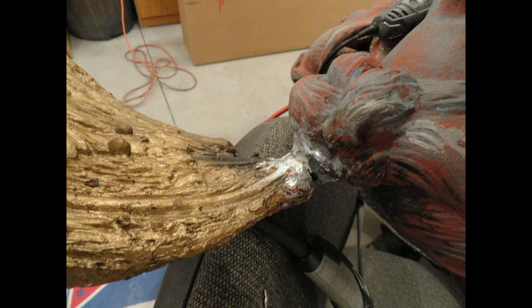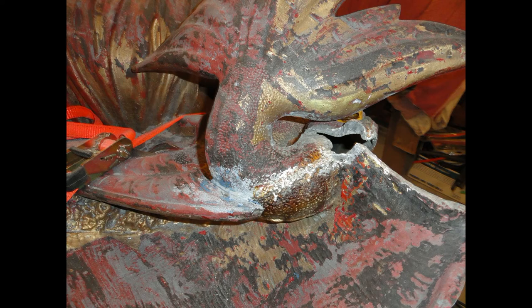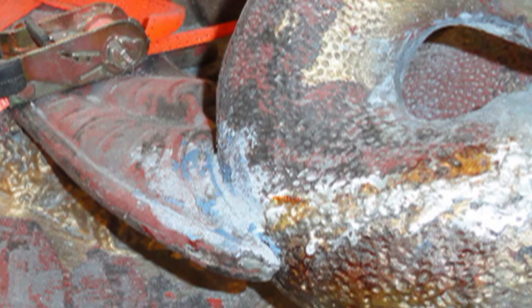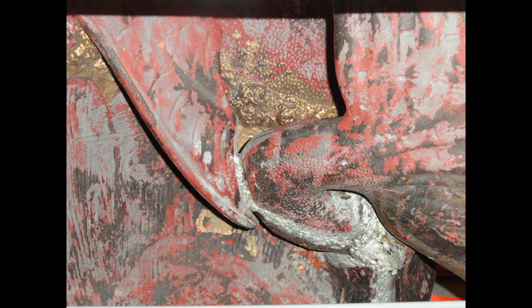The key to all of MuggyWeld.com's brazing and soldering rods is to broadly heat the parent metal or alloys before adding the rod. You will hear this over and over in our videos. You do not want the area being soldered to fight the adjacent cooler or cold area, as it will pull the heat from the joint, causing it to break or hole.